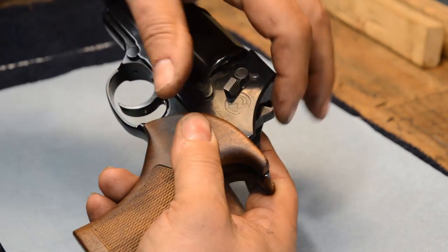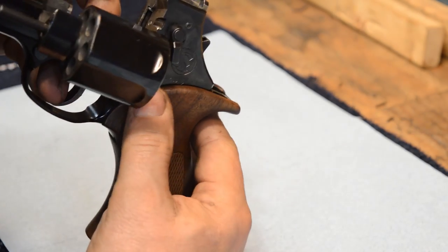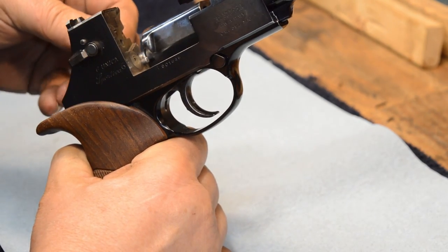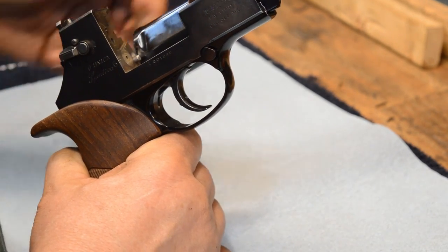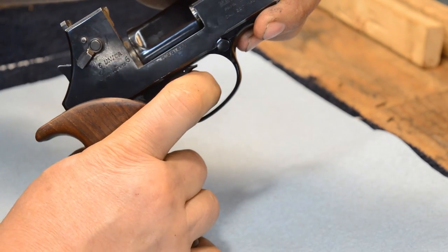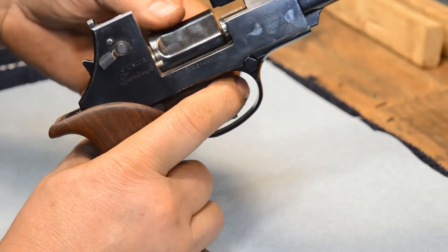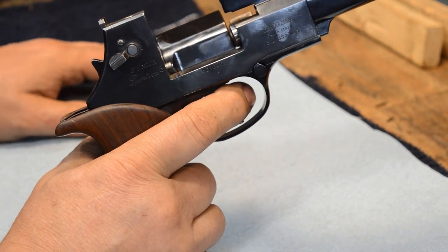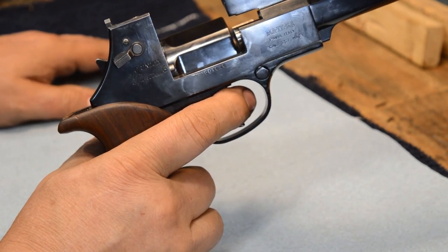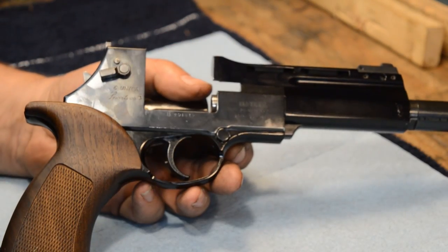The normal manual of arms says you let the hammer down, pop this lever, and that will come open. There's a locking stud in here that sticks out right there — that's what is retracted when you cycle the action. That stud can come and go, and this whole thing has just lost its manual index. We'll take it apart and see what we can come up with on the inside. When we put it back together I'm fully aware the recoil spring and follower have got to go in.